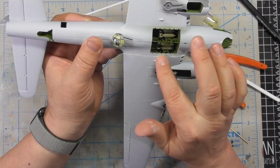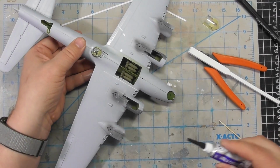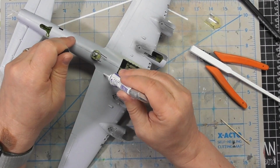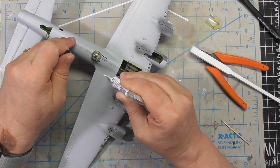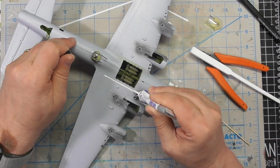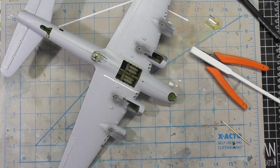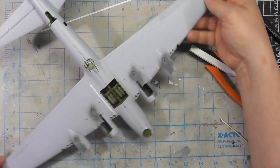See, that dries pretty quick, but it is sinking, so we are going to need some more, so I'm going to do that while we're sitting here too. One more thing before we go off the air. Again, this is why I like this applicator because it pushes it in the crack while it's putting it down in a straight line. I think I'm going to let that dry on there instead of cleaning it up this time, since I've already got some in there, and then sand it off.